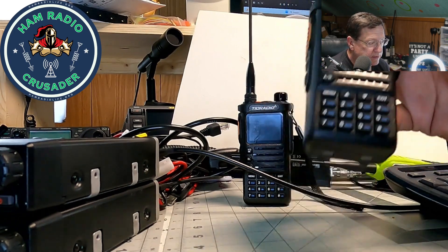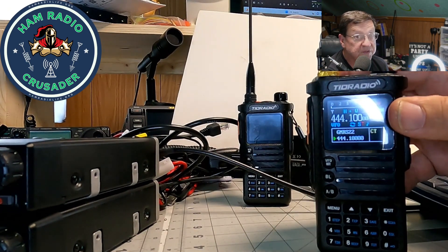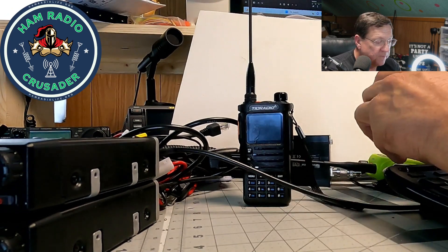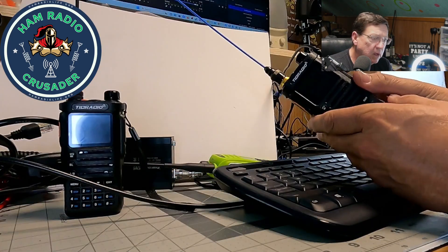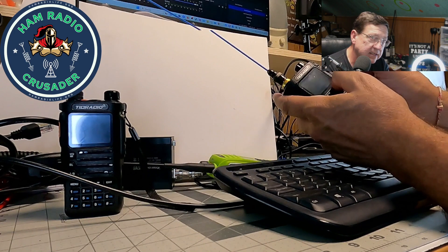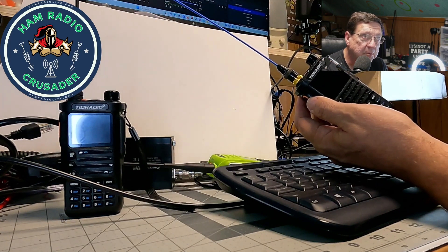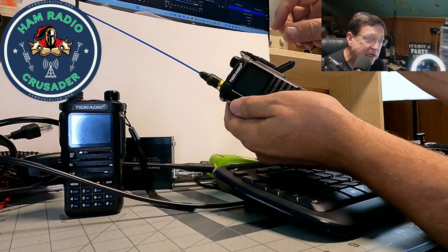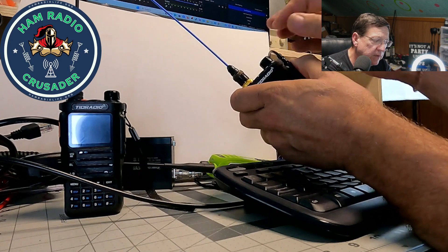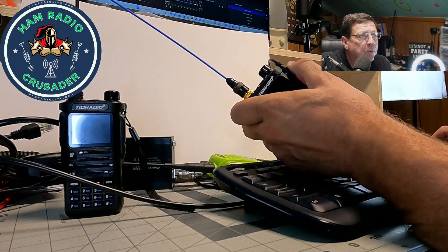This came to me as a Gen 2 but it didn't have a C-type battery — which they did send later, by the way, I did get my C-type battery. I've already backed up the code plug so I have programming software ready. I'm going to plug this in. You want to hold the connector in because these connectors don't seat down into that socket very well — it should have been a straight-out 90-degree in my opinion, but instead we got the money-saving L-bracket. You want to hold it down right there, and you want the radio turned off.